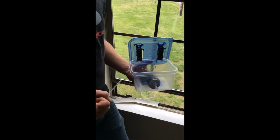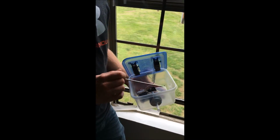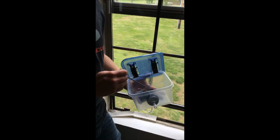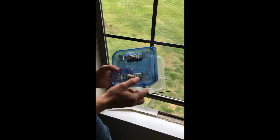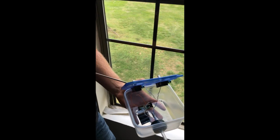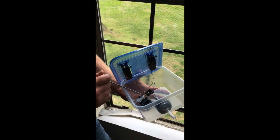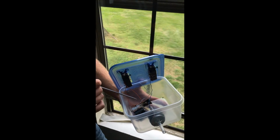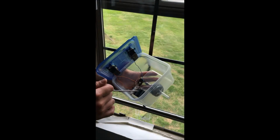To make our coil gun work, we all know that you need an induced current through these wires around our solenoid to launch our projectile out of our barrel. To do that, we start with a 1.5 volt battery. From there, the current runs through to our first switch, which is located on the right, to control the charging of our capacitors. From this switch, the current then leads back to our circuit board here, and then it is run through a series of transformers to step up the voltage, and then from there it charges our 3 capacitors, which we have wired in parallel.